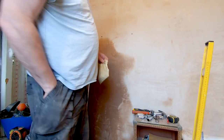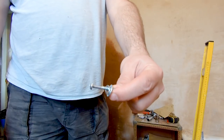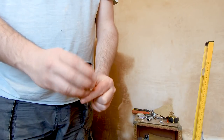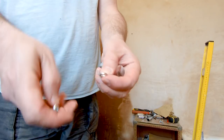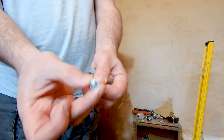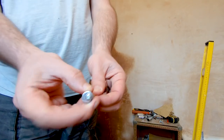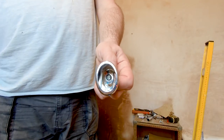Right, we've been to the shops. Just went to the local hardware shop - just a pound. They had round head screws with flat bottoms. The trouble is when you put them inside here, that screw is very close to the edge. I got a small washer but that still didn't give us enough room around the head and it could wobble and go through the hole. So we've got a larger washer to go over that - now that's got plenty of room and that's going to give us a better fix. I feel safer with those washers in there.